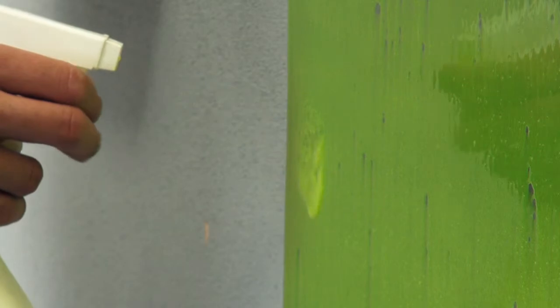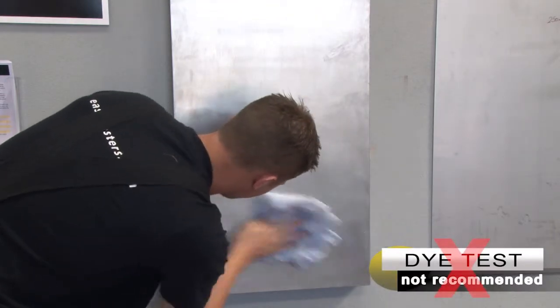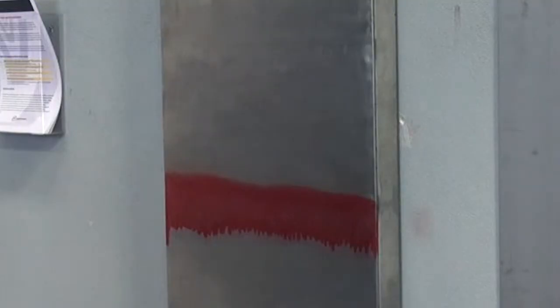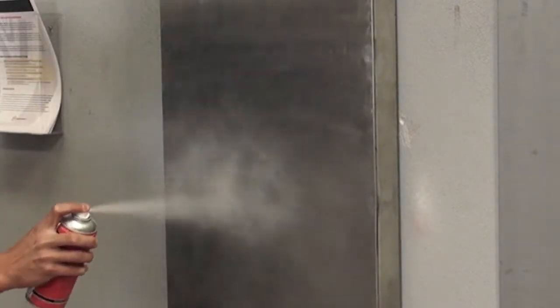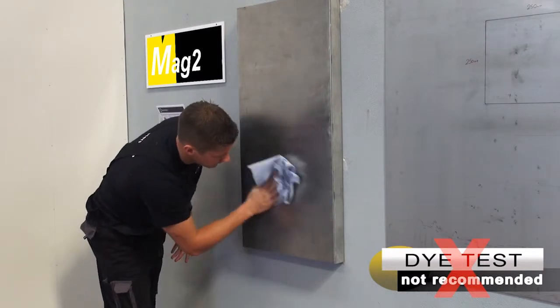Another traditional method for testing vessels is dye testing. However, this method has many limitations and inconsistencies, as shown in the following demonstration. The first method requires the vessel to be thoroughly cleaned, the dye applied using a spray gun, waiting for approximately one hour and then washing off the dye. The theory is that the dye will remain in the cracks. A developer is then applied and after waiting half an hour, some cracks will show up. Dye testing will not detect defects that are closed or filled with product residue, and a considerable time is involved: four to six hours.